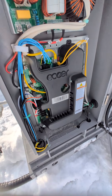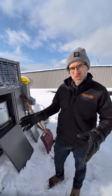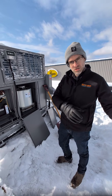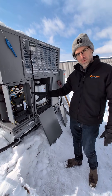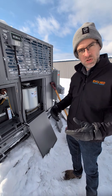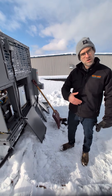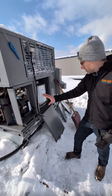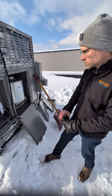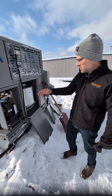The control board here looks similar to the one in the residential system. There are different part numbers — the two-to-three-ton board for the residential outdoor unit and the four-to-five-ton main board for this unit. As a distributor, that means only two SKUs on replacement boards. From a contractor's standpoint, technicians training on a packaged rooftop or a residential split system are seeing essentially the same thing. You have your power filter and your main board — simple and consistent.